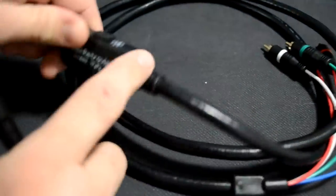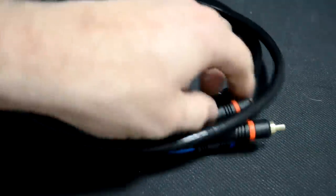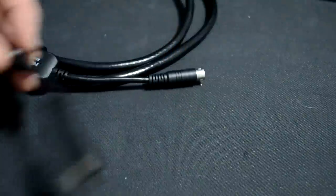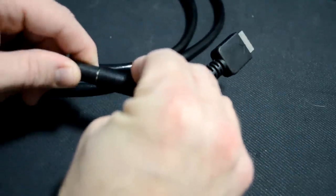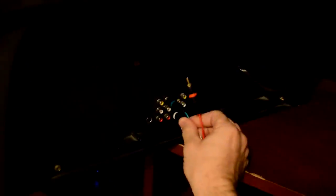To hook this CRT up with the best possible video quality, I'm going to use HD Retrovision cables — this is their Sega Genesis 2 cable. It's really high quality and very nicely made, works perfectly. It converts the RGB into a component signal for a CRT. I just needed this small adapter they made for the PlayStation 1 — it connects to the end of this Genesis 2 cable and gives you a component cable for the PS1, fitting nicely into the AV multi-out. This CRT has a ColorStream input, which is just component input — you put red and blue there, and the green actually goes into the yellow input since there's no separate green input.